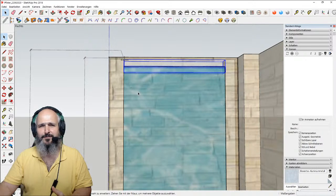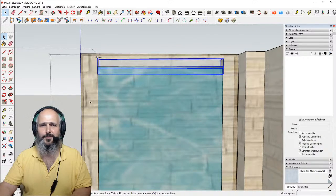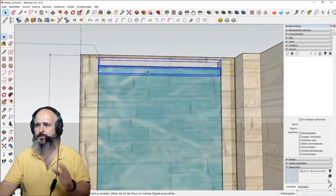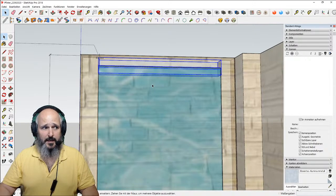So this is what we did wrong a lot of times at the beginning, until one of our employees found out the so-called Venturi effect, which means that if you infuse here from the side, you get a negative pressure here. So you almost get no water getting out here because all the water is flowing towards the middle. But this is explained in my Water Feature Project Mastery and also in the Glass Waterwall Mastery course.